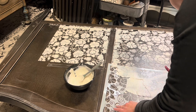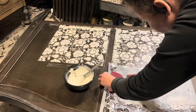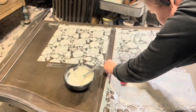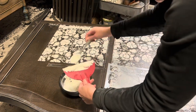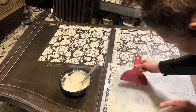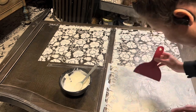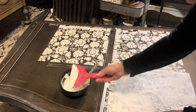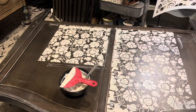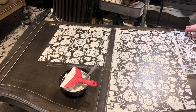I had time to wash my stencil and come back. The first application was dry enough that I could lay the stencil over the top without smearing what I'd previously done. This is a new batch of joint compound and a clean stencil — exact same process. I made sure the stencil was lined up with the dried section, smeared it every which way, shoved it up into the edges, then repeated. I can do this section and then come back for the last corners, working from side to side as everything dries.